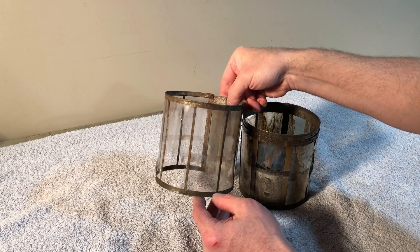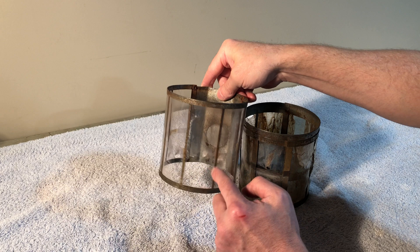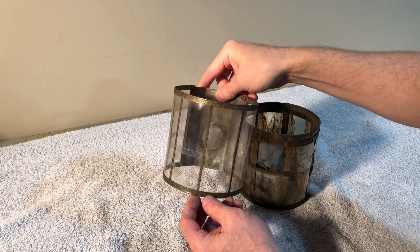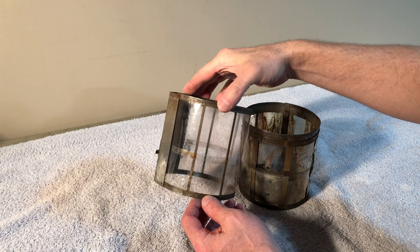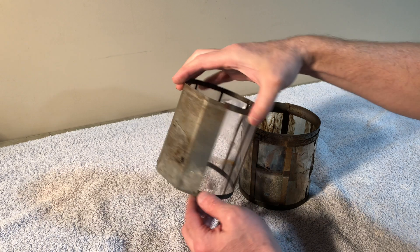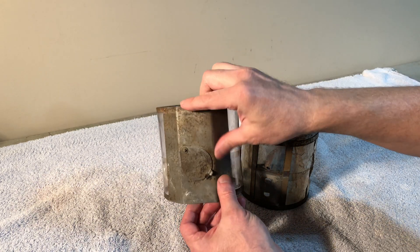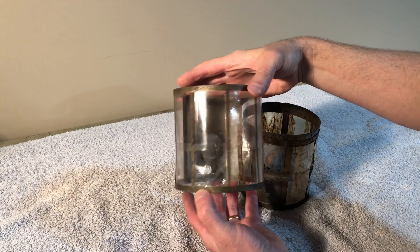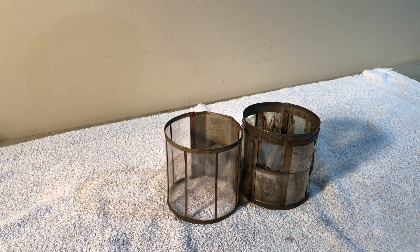This mica had a lot of soot on it. It was pretty dirty and dusty, and especially around the lighting hole that someone made, it was all sooty from matches going in there. The citric acid took off every bit of soot, all the grime, all the dust. It did a pretty good job of de-rusting the plate too, which was really caked on. And it's nice and clear — this is beautiful. That was citric acid.